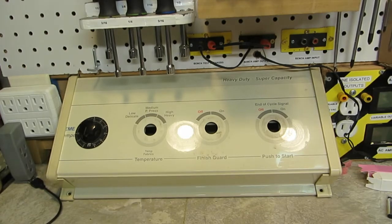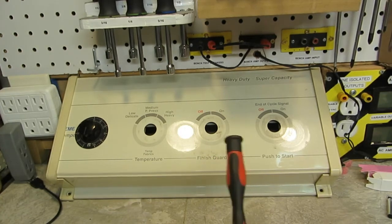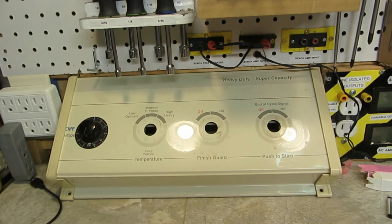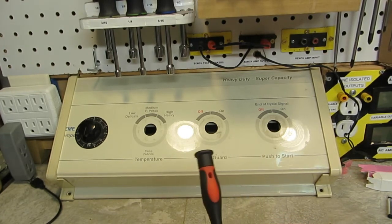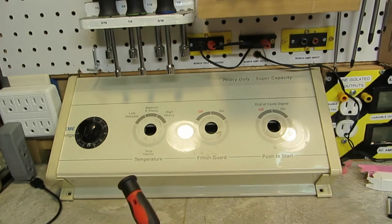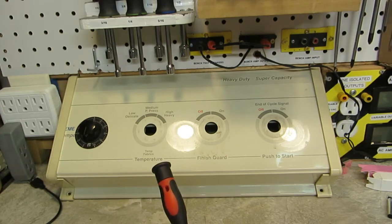Let me know your thoughts — anything else I can incorporate. The BK970 has a transistor tester built into it as well, but I figure if you've got a digital meter with diode settings, that would be sufficient for transistor testing. You really don't need a dedicated tester for that — I think that's kind of a waste of space on that tester, but somebody at B&K didn't agree with me. I've also thought about a small scope to go in there too, but I don't know — that might be pushing it a bit. I'm not a big scope user, and I think for signal tracing on radios, the RF/AF signal tracers we've been working with are more than sufficient. I don't think you really need a scope.